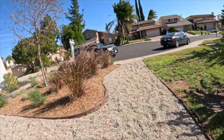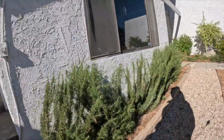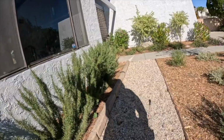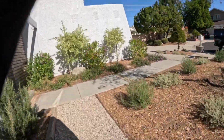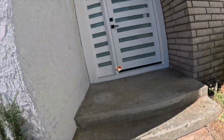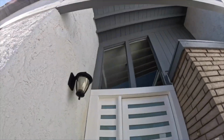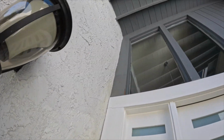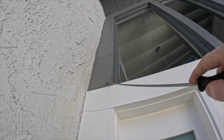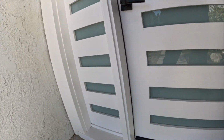The gold standard for replacement is to remove the entire roof, check the wood framing, check the roof deck, and replace any decking that is necessary. And when you do a permitted roof, the LA City inspector will look for insulation as well. So these roofers have to put in insulation when there's not enough insulation. So that's good too.